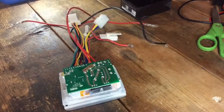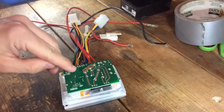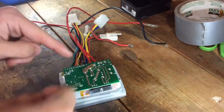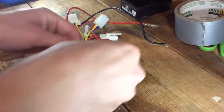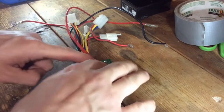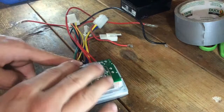So that's glue or duct tape in my case. If you decide to go with the glue route, just make sure you do not touch the glue to any of the metal or electrical contacts — you might cut off the flow of electricity and the mod will not work. Make sure that the metal is centered on both of those contacts, as you can see there, and press down very firmly keeping the bar in place to connect the tape. Make sure that this does not move — if it does, it will jump around and short out the controller, which is very bad.